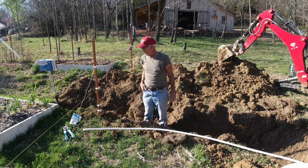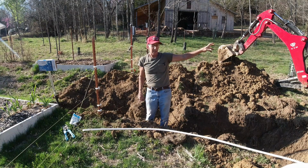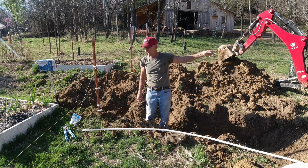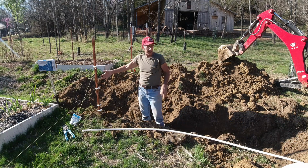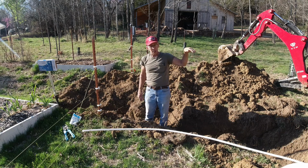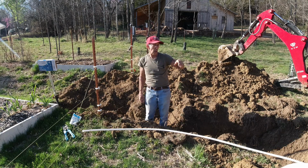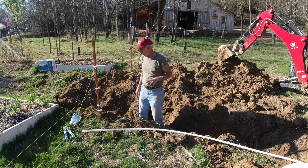I finished digging the ditches. So I have the one coming from where you saw up by the little building. All the way, it'll round a corner here, come to my garden at this point here, and then there will be a drain line that, fortunately I'm on sloping land, will all be a gravity-fed drain line, and that'll be a 1/2-inch line that I'll put in that'll end up down near my property line.